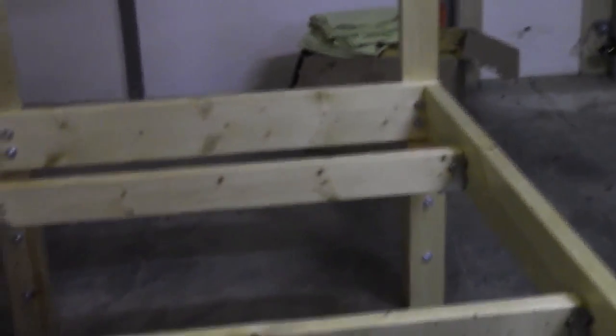which goes on top of the box frame here, and that is what will hold up the mattress. Now please do put a lot of varnish on this plywood here so that it's more durable. This is OSB plywood. It's a wood chip kind of stuff. It looks kind of rough, but it's not going to be seen because it's going to be underneath the mattress, but you want to make it more water resistant, so put that varnish on there too.